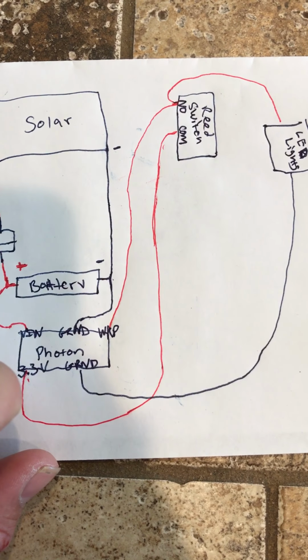My loop, all it does when it turns on is it says, hey, publish an event called mail with a value of on, and then wait 5 seconds. Basically that's the delay 5,000. That's just to make sure the message gets sent before it goes to sleep, make sure it gets out there, and then just go to sleep until the wake up pin, the WKP, is rising or gets a rising voltage.